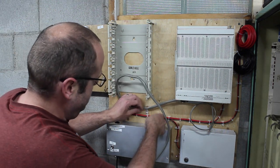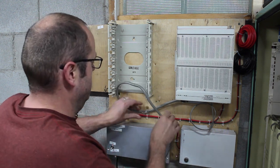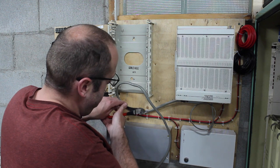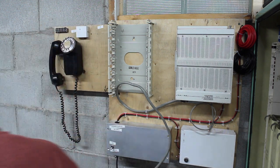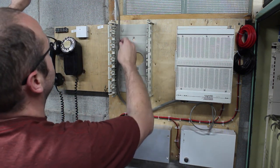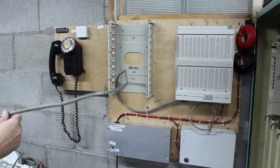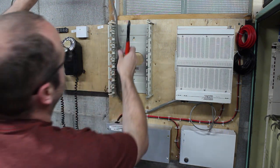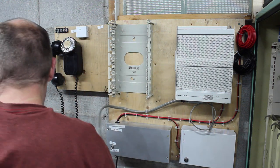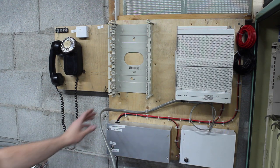So my first zip tie, because in short order, there will be more cables in here. All the data guys are going, no, zip ties are bad. This is kind of a set it and forget it situation. This stuff goes in once. So the typical Bix installation instructions say you give yourself 16 inches of extra cable beyond the end of the panel. So eyeball 16 inches, call it that. And that gives me, I've got 150 feet of this stuff coiled up here, so I'm not too worried.